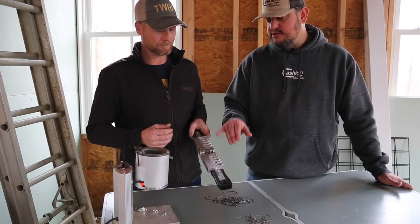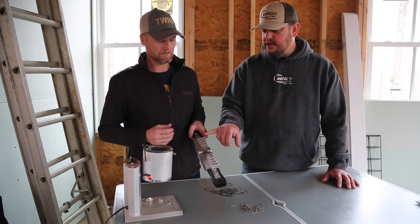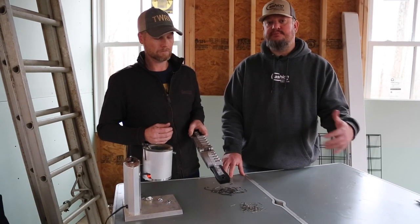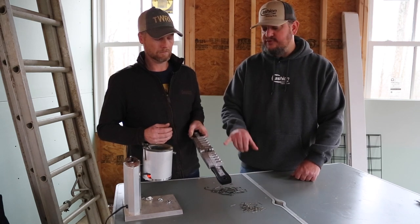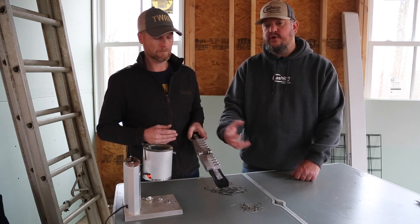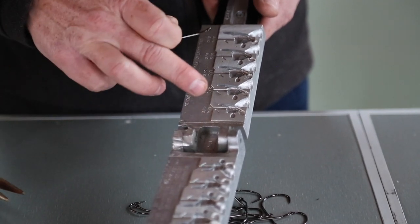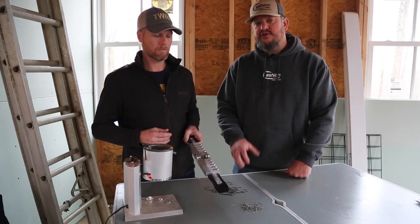What's really cool about these molds is that they actually break down into multiple sizes. So depending on the mold that you pour, you can get anywhere from a sixteenth ounce all the way up to two ounces, depending on what type of lure you're making. Based on the size of hook and how much lead goes on that hook, that determines the amount of weight. So it gives you the opportunity to ultimately get really picky and really precise on the weight of your lure.